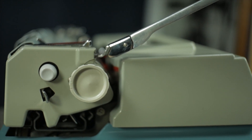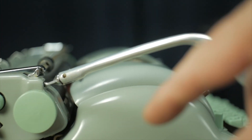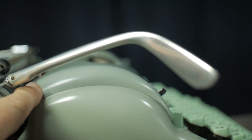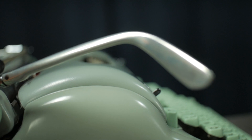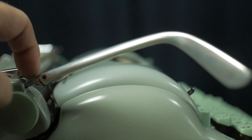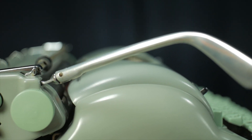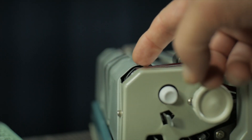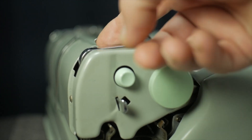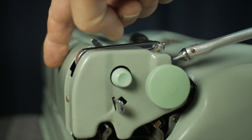The clearance between the bottom of the carriage return lever and the ribbon cover is a good amount on the 1972 version, whereas on the earlier version it's a much tighter clearance. In fact, there's some scratching on the ribbon cover of the earlier machine because the bracket was a little wobbly due to a lack of washers at the mounting point — so there's more chance it will be scratched up. On the rear panel where the paper fingers are, the later version has a sharp crease, whereas the earlier version makes a continuous smooth round transition to vertical with no obvious crease.